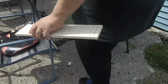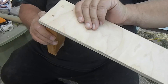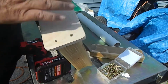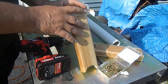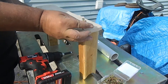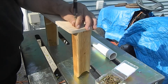What I'm going to do next is place these uprights on and shoot some screws up through the bottom. We're back and now we're going to screw the uprights to the base. I drilled some holes, and off-camera I rounded off the base and made it look a lot nicer. I've got some two-inch steel screws and we're going to use these to screw the base to the uprights.